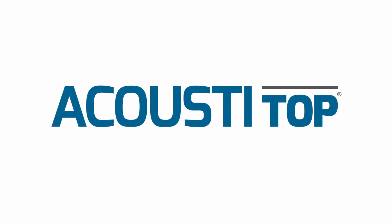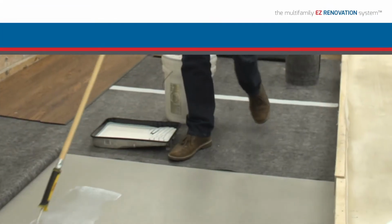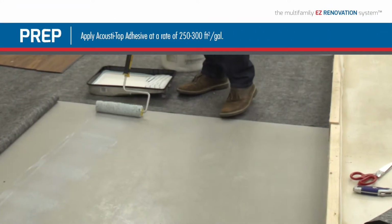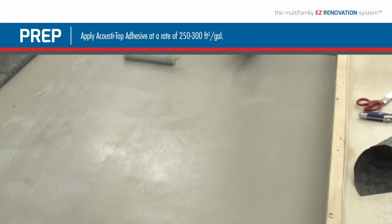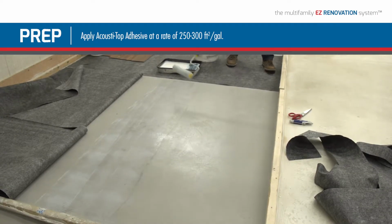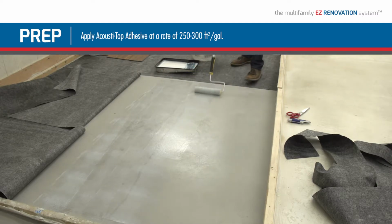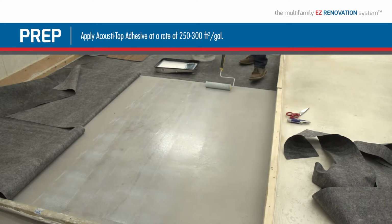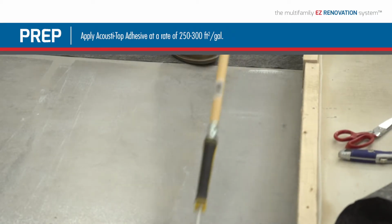Ideal for multifamily renovation and new concrete construction, Maxxon's Acousti-Top offers sound control when a permanent mat is not an option. Over a properly prepared substrate, apply undiluted Acousti-Top adhesive in 4-foot wide sections, the width of the Acousti-Top mat, at a rate of approximately 250 to 300 square feet per gallon, depending on substrate. Rough or coarse concrete may need 2 coats of adhesive.